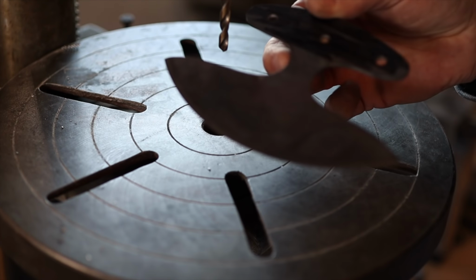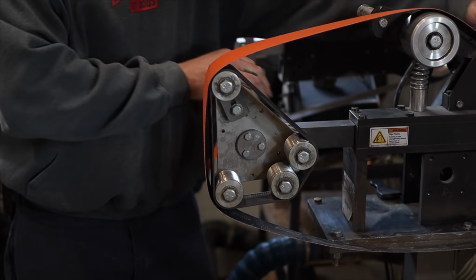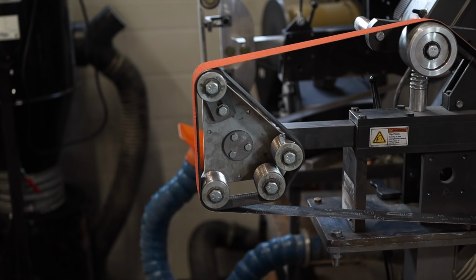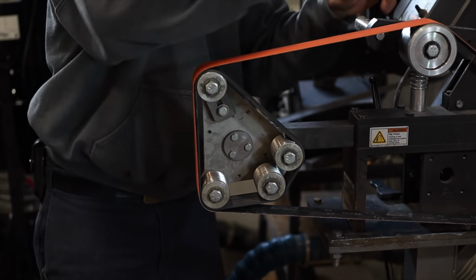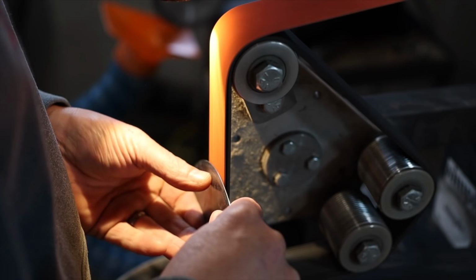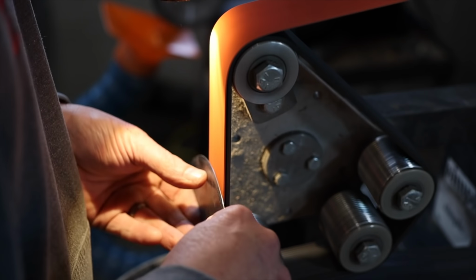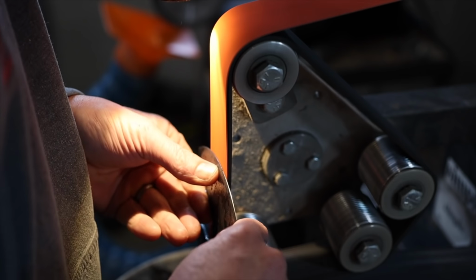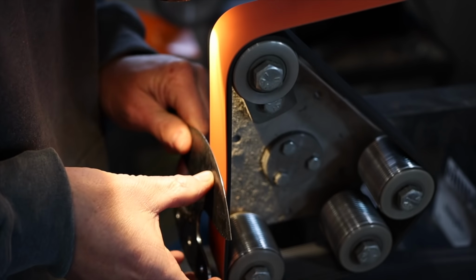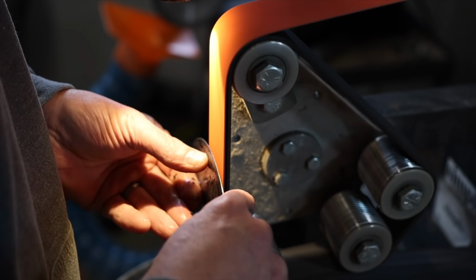The ring of this steel was fascinating me, obviously, throughout this entire build. Now, with this being a mystery steel, I have no idea what it is, what series it is, but I found it very interesting when I was grinding. Normally, when you grind a knife steel, it creates a kind of steel wool, with long, stringy fibers. This almost was like a powder. As I'd wet things and my hands were wet, the steel would stick to my hands. It was almost like wet chalk or something. It's really interesting. It seemed as though the stuff ground finer somehow.